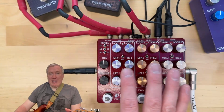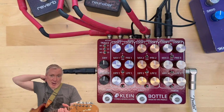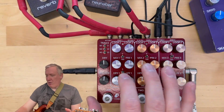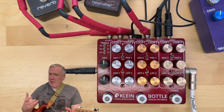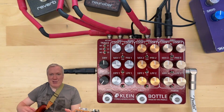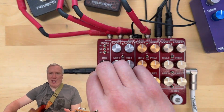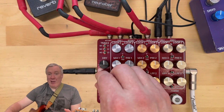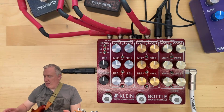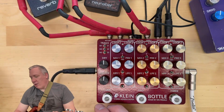When you are in bypass mode, the circuit is actually not true bypass. I mean, I'm going from mono to stereo right now. There's no way to do that in true bypass without loading a bunch of stuff down. And so there's actually kind of a unique technique I'm using, which involves the use of the master knob. But I've created a circuit that should not change its volume, even though it's actually running through this control right now. But when you turn it on, then the master knob is active.